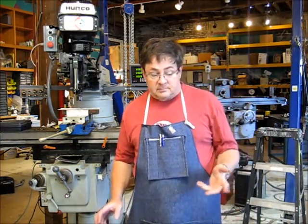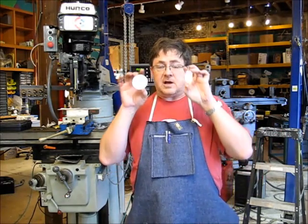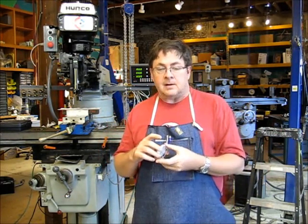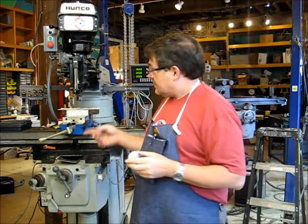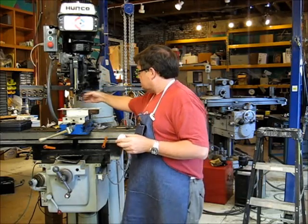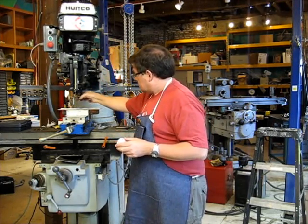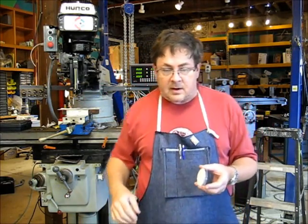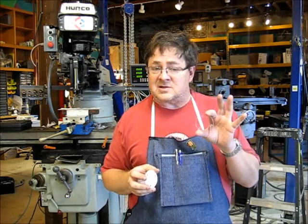All right guys, we're done with that little project. We got sight glass lenses. So now you know how to make these. And they're pretty easy to make. Of course, having the right equipment really helps. The ValCut setup here is a very nice setup for doing this kind of work, for doing OD and ID work. Don't think you can only cut plastic with it.